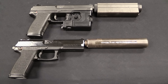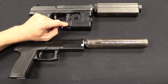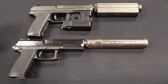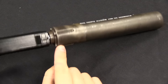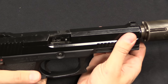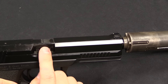The Phase 1 pistol went very nicely — it passed a 30,000 round insane endurance test. But there were a few things that needed to be changed: the suppressor for one, and the laser aiming module. In Phase 2, HK wouldn't actually be building the final aiming module itself anyway — that would be subcontracted out to InSight Technologies. They made a few changes to the gun and a big change to the suppressor. In addition to getting rid of that weird extra block underneath and making the whole thing a little bit longer, they also added these springs to improve reliability of the pistol with the suppressor attached. Because this is a Browning tilting barrel type of action, you've got this big weight hanging on the end of the barrel that really messes up the balance and harmonics of the thing trying to cycle properly.